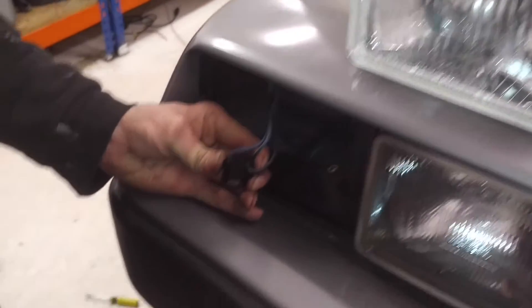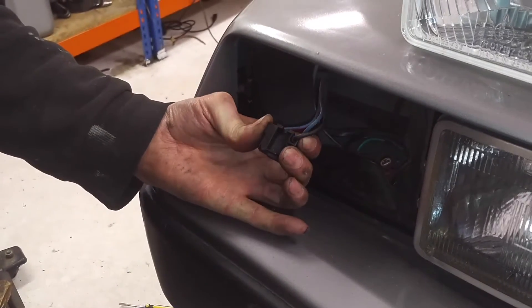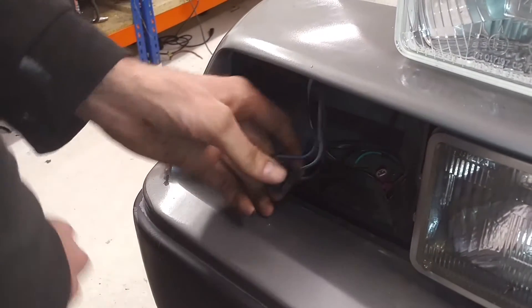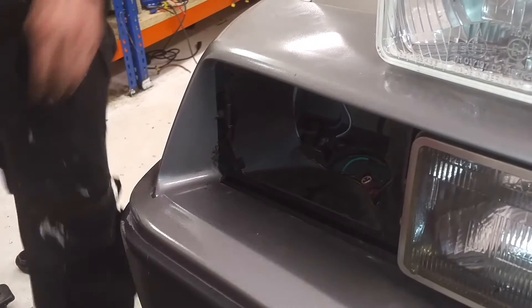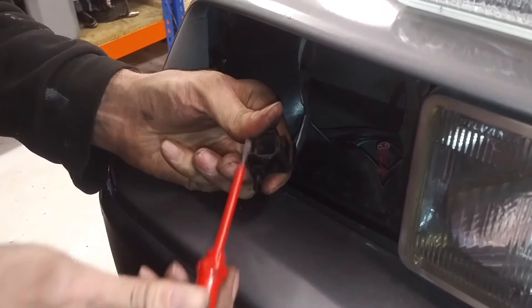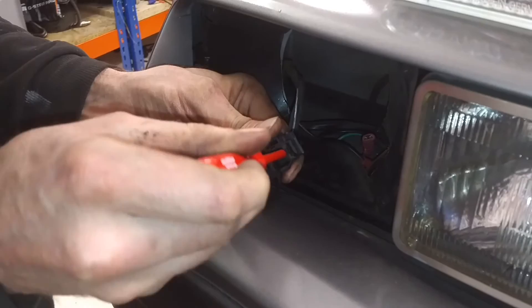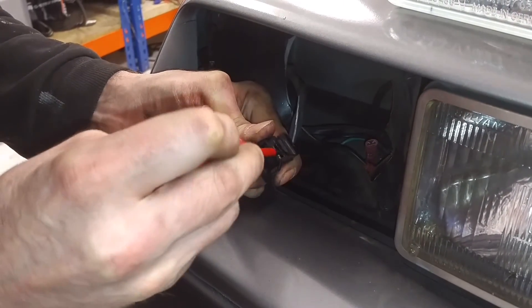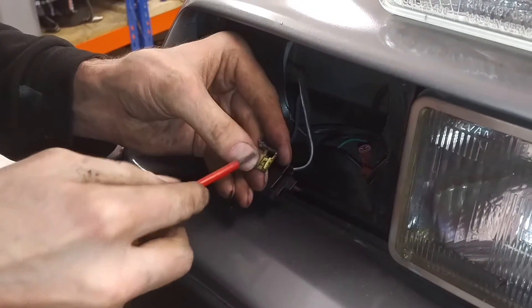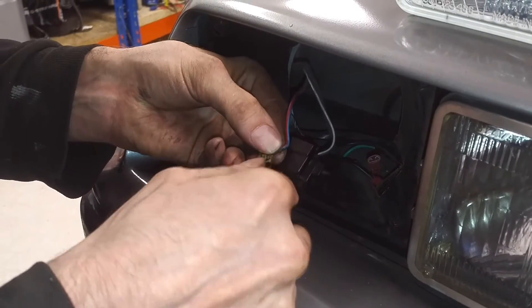This is the original wiring where the plug comes out like this with the middle pin on the bottom, and you'll be turning this over and reordering the pins. It's very easy to take the pins out — take a very thin screwdriver, go in on the gap around the pin, give it a very gentle lever, and it pops straight out. All you need to do to get it back in again is to bend that tab back up again.